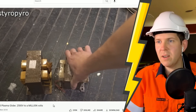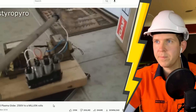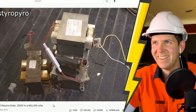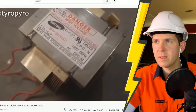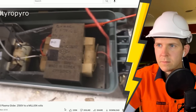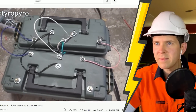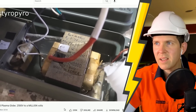This is gnarly. I need transformers with relatively similar electrical characteristics - that way they don't fight each other when chained together. I found four that match each other quite nicely, and I wired the secondaries in series with the primaries in parallel, accounting for phasing. Now if you try to chain any more than four of these together, the voltage is just going to blow through the winding on the secondary. But even at just four this can be an issue, so to prevent this I mounted them in ammo cans and submerged them in mineral oil. This arrangement gives a voltage of about 10,000 volts, which is certainly impressive, but still off by a factor of 100 of what we actually want.